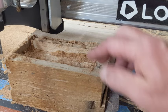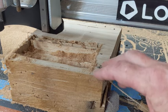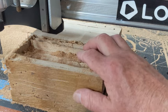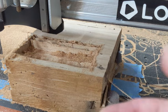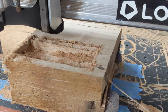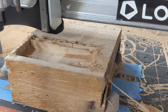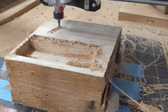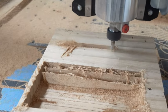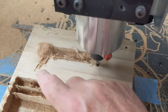Now we're going to run it as an offset rather than raster — we'll start in the middle and work our way out. Typically when you're doing a roughing cut, that's the better way of doing it instead of a raster. It works better on the machine; it's always in a conventional or a climb cut. We're running the trim router at speed setting 5.